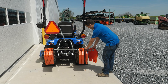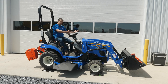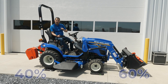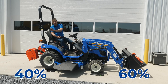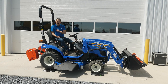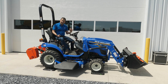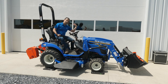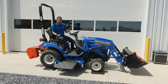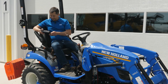Loading up our tractor with a fairly typical 500 pounds on the three-point hitch, we've moved the center of gravity back so that we're back to a 60-40 split — about 40% at the rear and 60% at the front. That's still not quite desirable, but even so, 500 pounds has moved several hundred pounds off the front axle back to the rear, stabilizing the machine and making it nicer to work. Let's keep stacking weights and see where we end up.